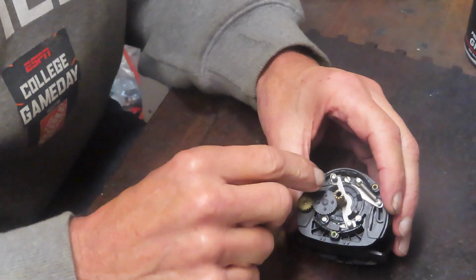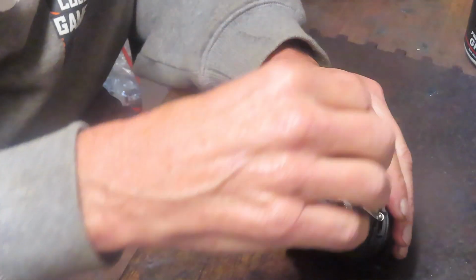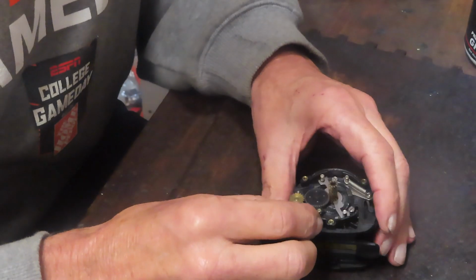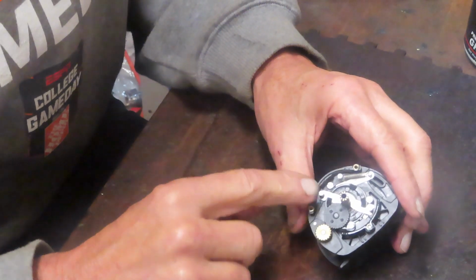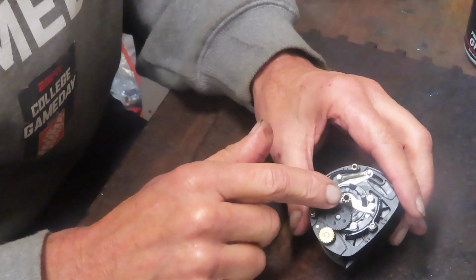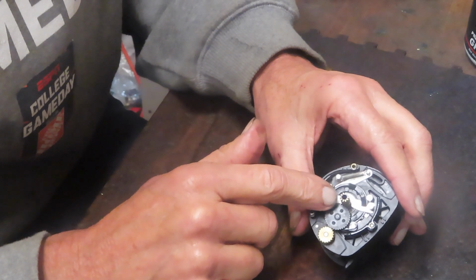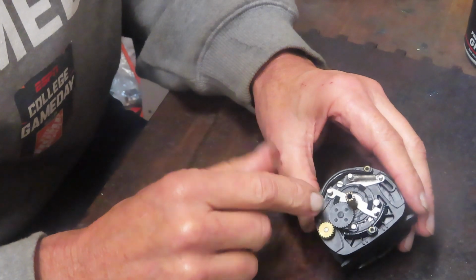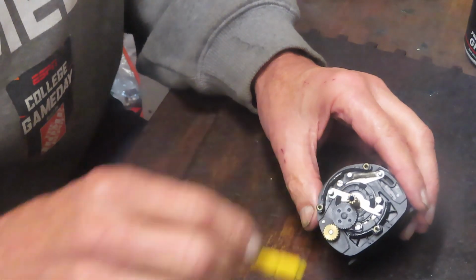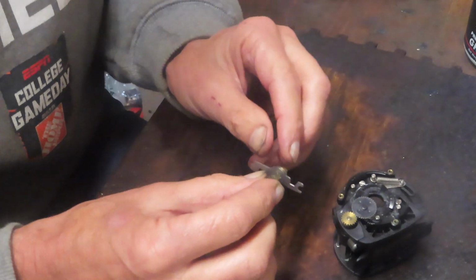I want to pull that pinion gear out now. I'm going to take the 2 springs and put them into my parts tray. Now I should be able to lift all. Pay attention when you start pulling pinion gears and things, orientations. The main threads of the pinion gear are facing outwards. The cup for the spool would be facing inward. And notice that the hump in the yoke assembly is to the top. That'll enable me to get this out.